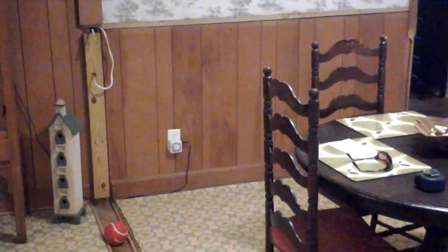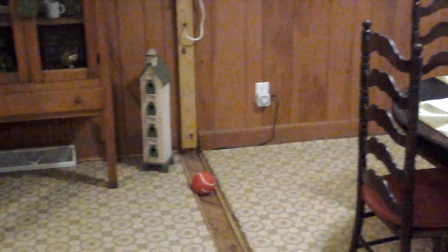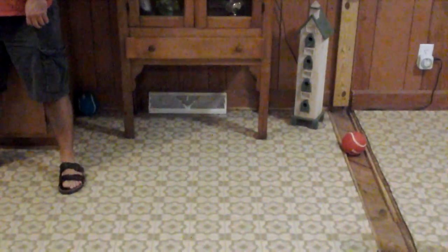Delete outlet on both sides of the wall. We're going to put a peninsula right there, so that vent's coming out of the wall — we're going to put it underneath the cabinet, cut out the cabinet. Need an outlet on the peninsula, and an outlet right there in that area, and the same thing over here. Need a switch for the dishwasher. There's a light — need a box and a light for over the sink.